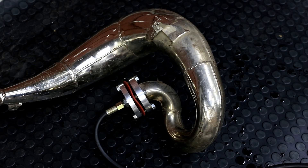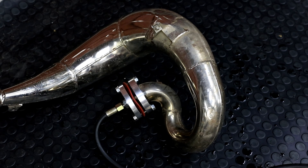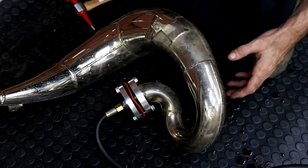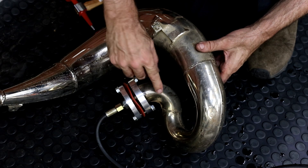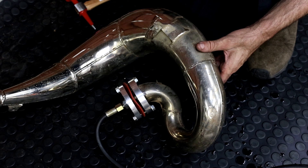I'm going to start pumping now. It's on zero, going up quickly — 200 PSI, 300, 400, and that is 500 now. I'm going to leave it at 500 and do some hammering. I'm going to hammer along this ridge here and try and flatten it out, which will make the neck straighten out more.